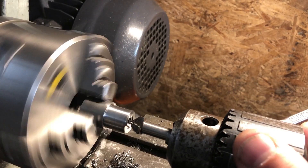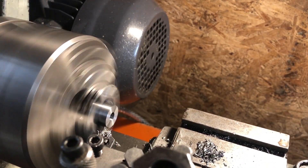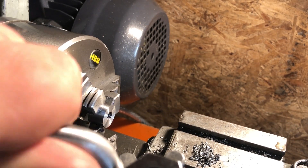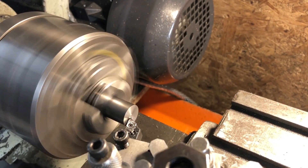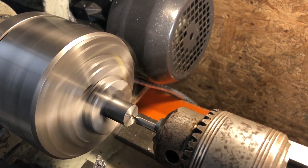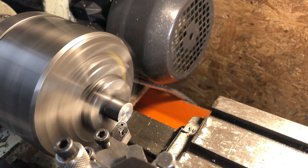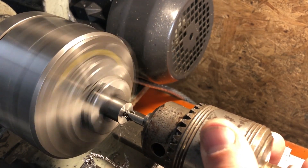A light countersink completes this side. Eventually there will be a cross hole for a grub screw and features to locate the plunger arm, but for now I'm simply facing to length and adding a chamfer and countersink — good enough for my test piece. With that done it's onto the shaft itself. As I will be turning this between centres, the first step is to face and centre drill both ends. I'm leaving the part approximately half an inch oversize, a quarter inch either end, and will face to final length once finished.